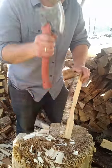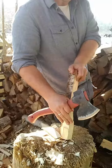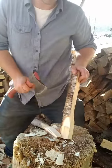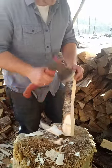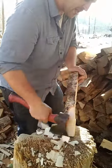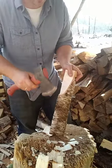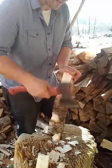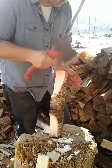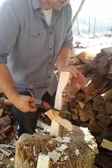When I'm axing down here, I'm axing to the side of me so that if my axe goes too far I'm not going straight into my leg — turn your body to the side. When I'm farther away from my body down low I can be a little more aggressive, and watch how nice and gentle I get as I get closer to my hand. The good rule of thumb is to never let the axe go up above your hand, particularly if it's close to your hand.